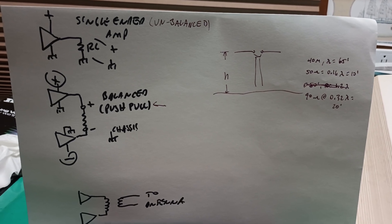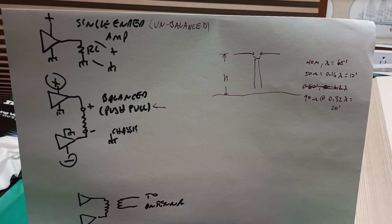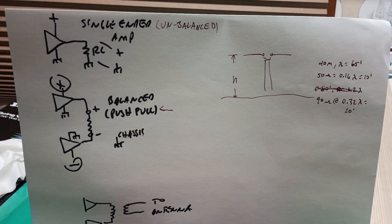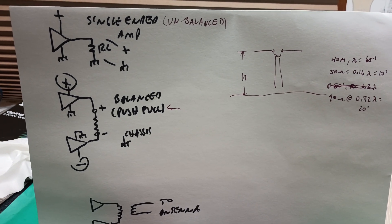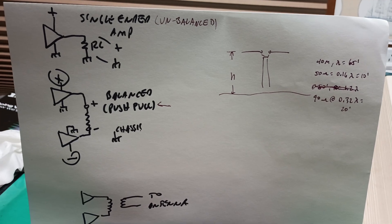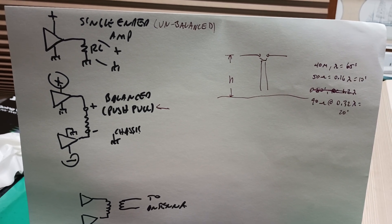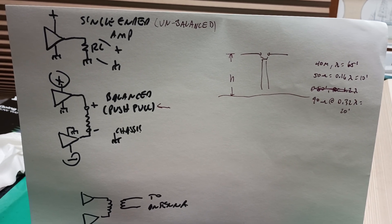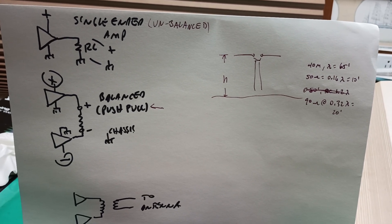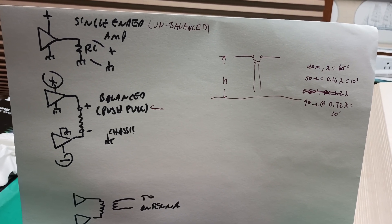The problem is that Balanced and Unbalanced don't exactly apply to transmission lines and antennas — that's not what those terms mean. What those terms mean refers to the amplifier used to drive them. It's only incidental or coincidental to then refer to a round 50 ohm coax as unbalanced. The two conductors inside could care less; they don't know the difference. But if you look in your book for your radio transceiver, the antenna output is listed as 50 ohm unbalanced — and that means the circuitry inside the radio.